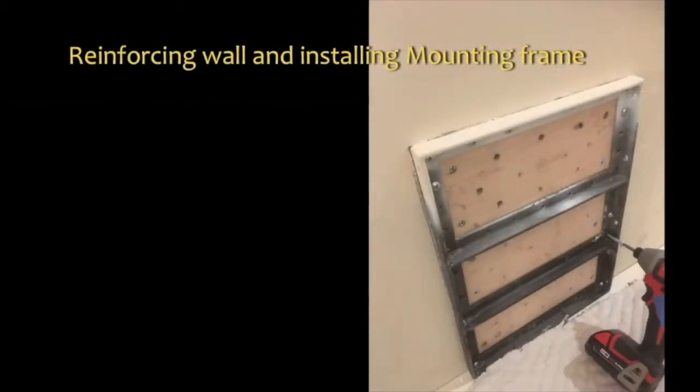The wall we attached to was designed to carry significant loads. Steel framing covered in structural ply, then finished with sheetrock. The screws are rated each at 1,000 pounds of shear. That's at the structural ply. The sheetrock would be easily crushed by the shear forces, causing the screws to bend or pull out of the ply. Knowing this, we cut the sheetrock out of the area of the steel frame and added another layer of structural plywood. Now, not only would the frame be mounted directly to the ply, but the screws would have the proper embedment.